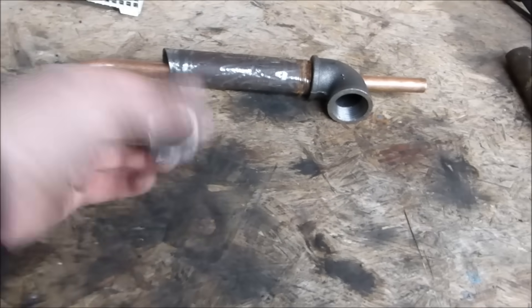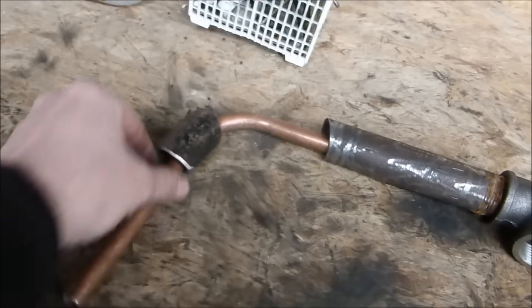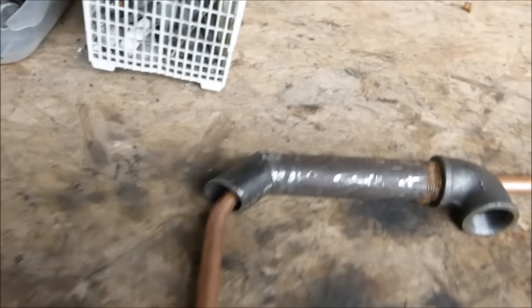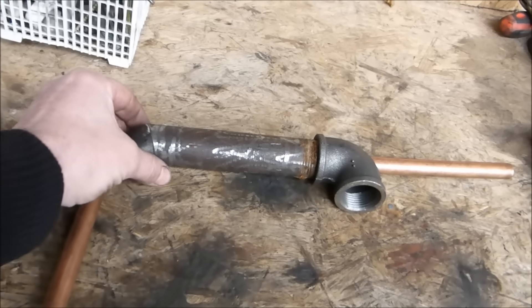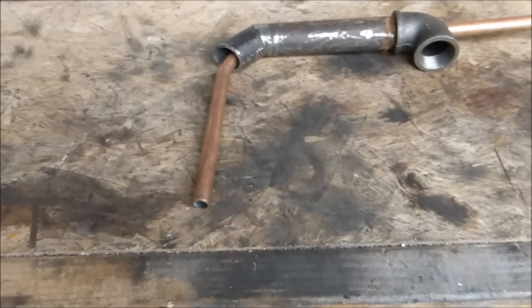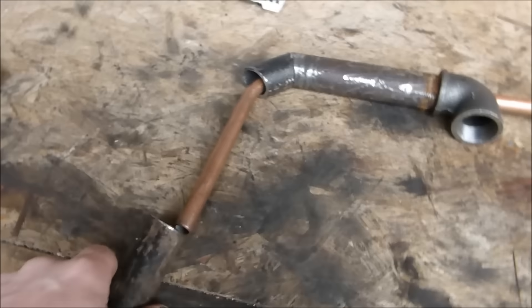This is why we've got this double 22 and a half degree piece. What I want to do is make a bend, and I want no joints in this half inch pipe. This half inch pipe is the oil line, and I want it to travel straight through that one inch pipe without coming into contact with the flame — the air kind of cools it down.